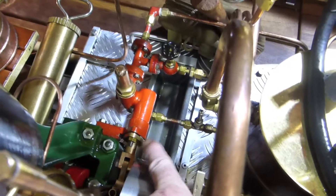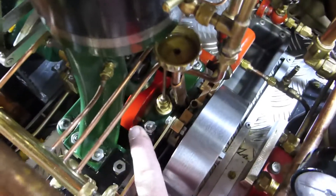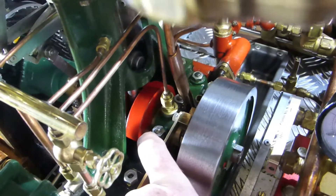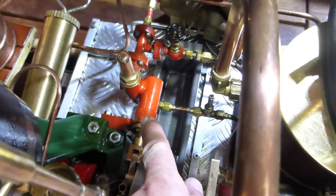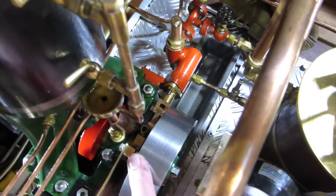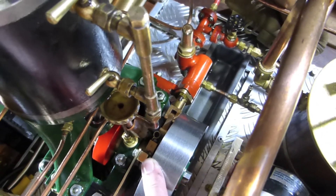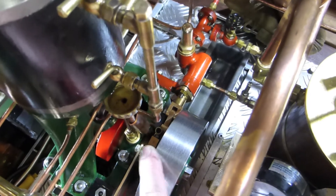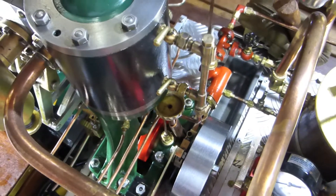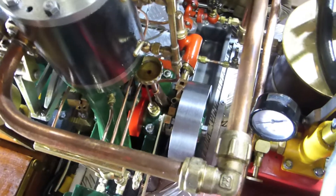Important is the position of the pistons: the crank coming from the top with the main piston at the bottom corresponds to exactly when the water pump piston is at its inner position. This allows quite balanced pumping, and the machine runs very smoothly and without any knocking.